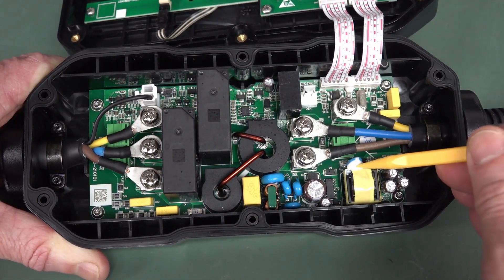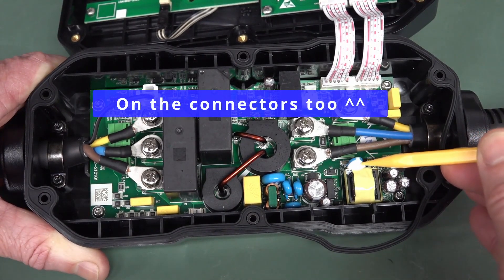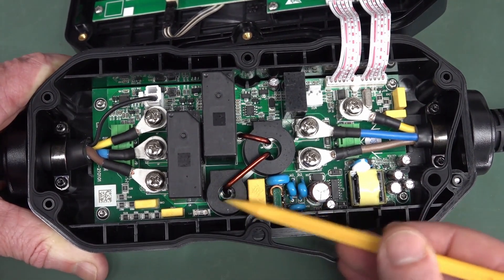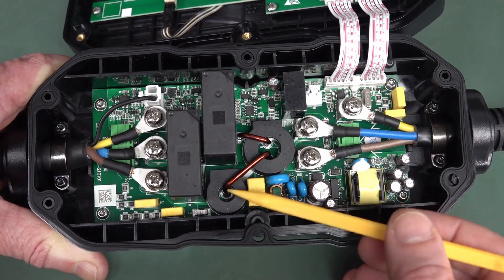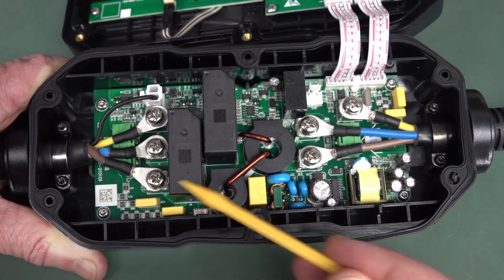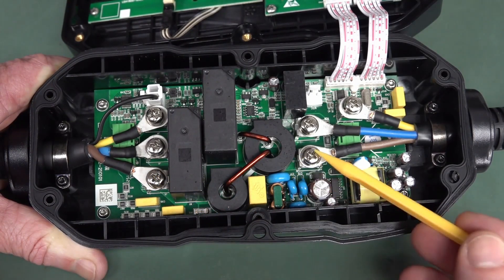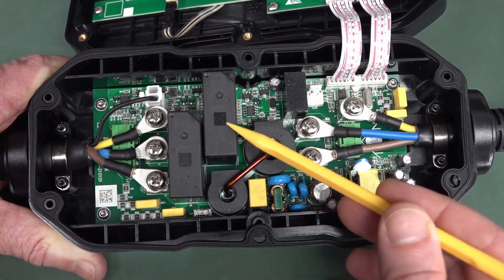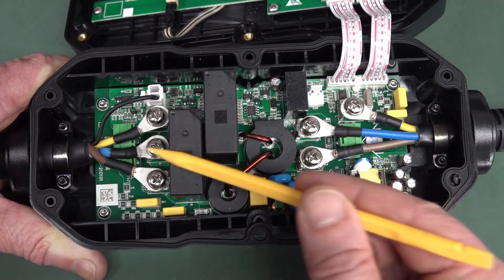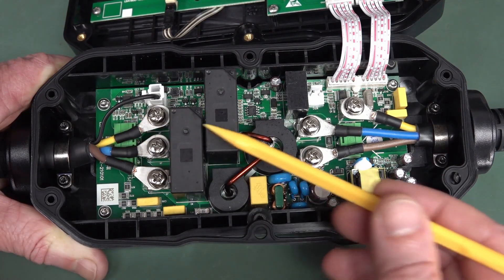Small touches here — they've put some Celastic down for whatever that is. That's just a cap labelled C. Then we've got what looks like a current transformer, or maybe a Hall effect sensor in there. That'd be measuring the active. So this relay here would be switching the active, and this relay here would be switching the neutral, which is the blue one. Here in Australia we have brown for active, blue for neutral, and green for earth.